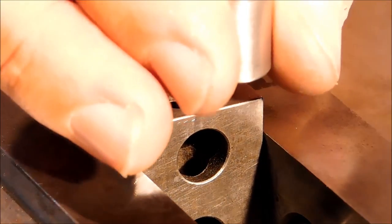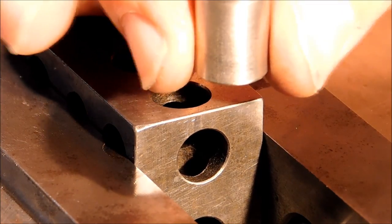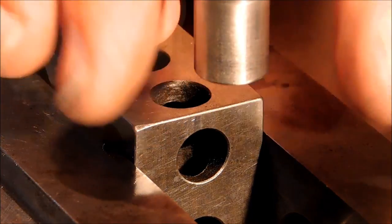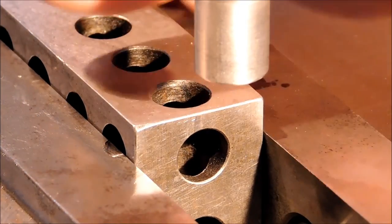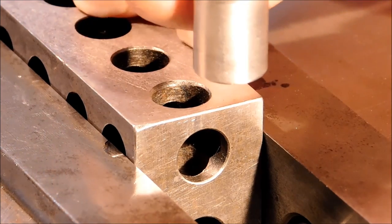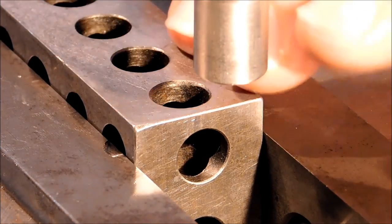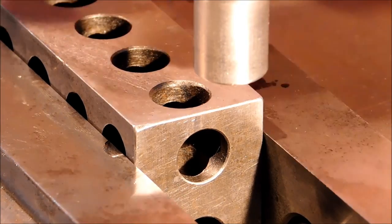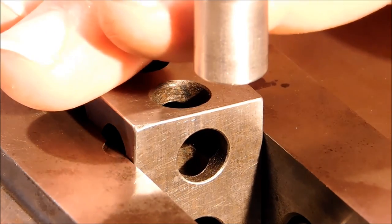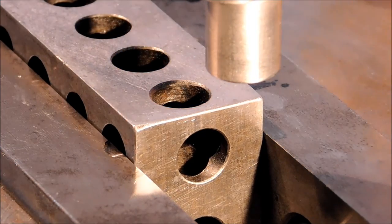This is a very good project to do, and one of the benefits of having a cylindrical edge finder versus one that is necked down is if you're doing a really large diameter part, you can still get this against the diameter of the larger part. Some of the ones that are necked down to 200, quarter inch, whatever, it is a little difficult if you're doing like a 6-inch diameter to get this right up against the center line of the part and watch for an indication that you have found what you're looking for.